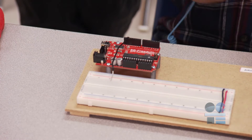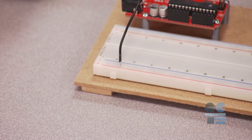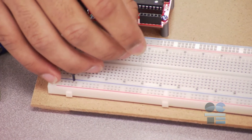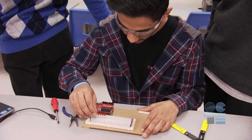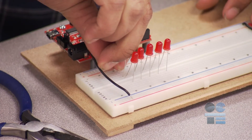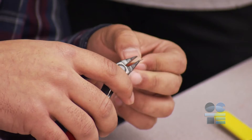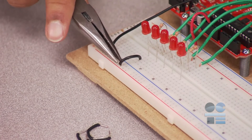Now we can lay out our components on the breadboard. Keep in mind that we want to avoid potential short circuits. Neat circuits are a lot easier to debug than a mess of wires and components. Take note of the orientation or bias of the LED — the short leg faces the negative direction, the long leg faces positive. Note that the wires may be clipped, so use the flat end of the housing, which signifies the negative side. Place it the wrong way and you may smoke the LED, rendering it useless. We need to use a small resistor, usually 330 to 600 ohms, to protect each LED from excessive power, which could also cause it to pop. If component legs are too long, use wire cutters to shorten them, or spread them out to keep the wires as low as possible to the board.